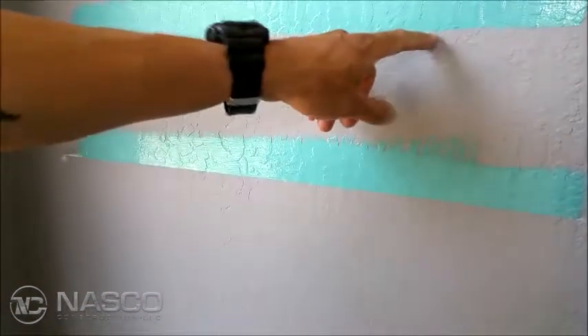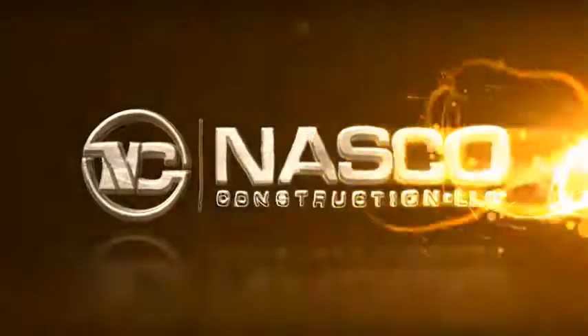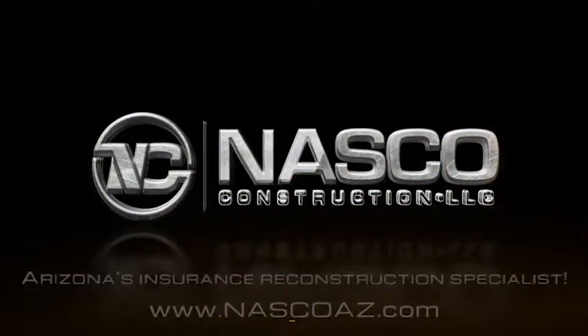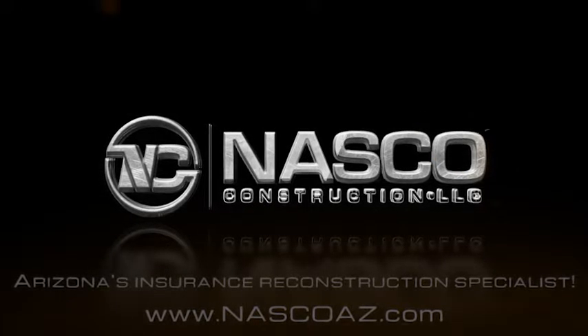You can see the difference. Usually you don't break a paint line right in the middle of the wall, but if you did this on a corner, up at the ceiling or on a bullnose corner bead, it would be laser straight. You still have a little bit of touch-up to do, but versus the alternative, it's the only way to go.